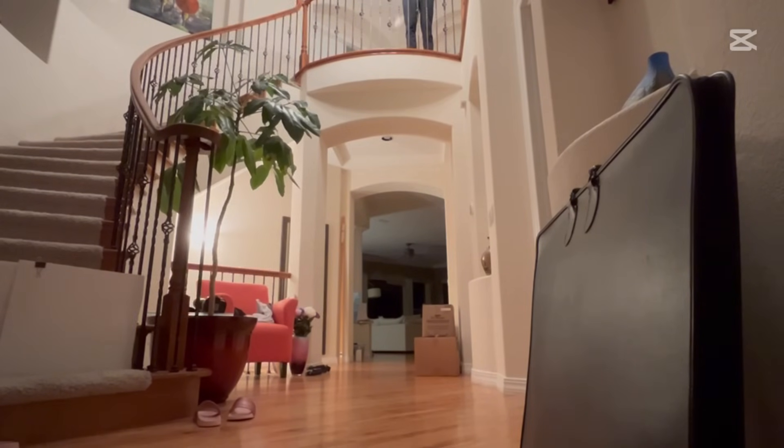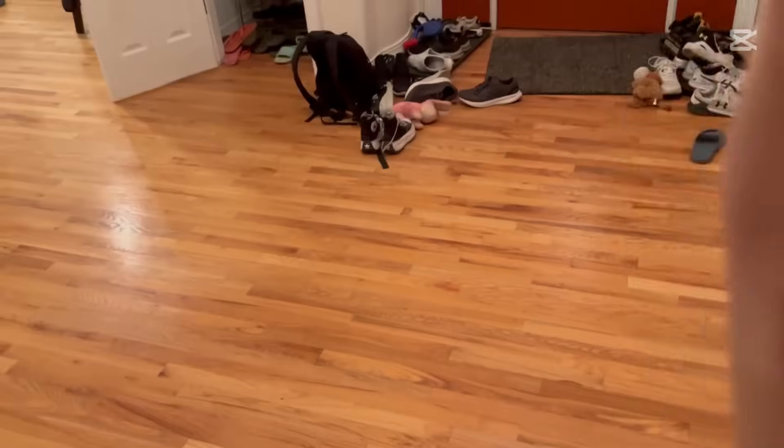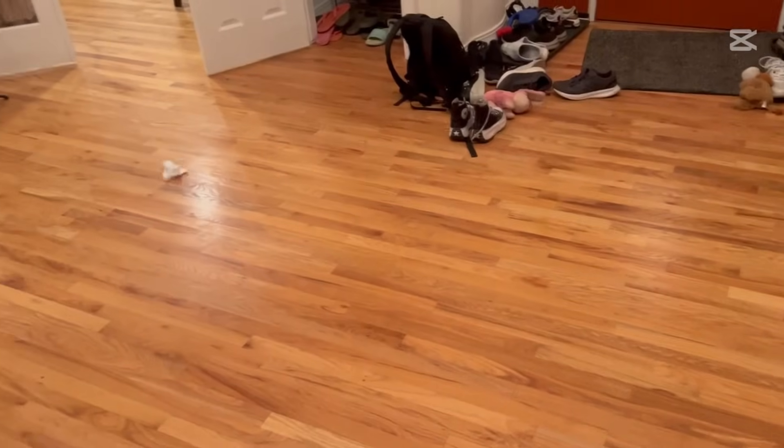This also came from me not releasing it perfectly, and it became kind of annoying because every time it messed up, I had to keep going down the stairs and back up to test it. After many tests where it just slammed into the ground or hit a wall, I was able to get a semi-decent flight where it remained sort of straight and almost leveled out. It still seemed a little too nose-heavy, so I moved the CG slightly back and removed the up elevator, so hopefully when it levels out it has a positive angle of attack.